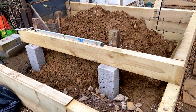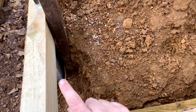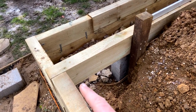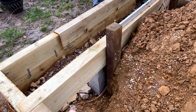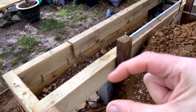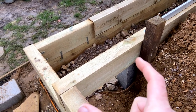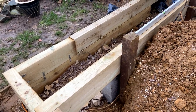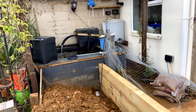All right, so when we come down the back here now, one thing that I've got to put in place is a small separate amount of wood. Let's try and get a better angle on that. So a small piece of wood down the back just to elongate that. And the reason for that is when this gets filled, because this has got no additional panels below, the earth will naturally fall away. So from the other side, you will get a small gap, and I don't want there to be any air. So by putting a little support behind, like a block of wood, I'm going to use some old decking wood down there, just a couple of inches. When it comes to fill, it will have something to trap against, and then it'll sit up. But you'll see that as and when I do it. So, you'll see there. Let's try and zoom in for you.